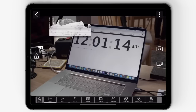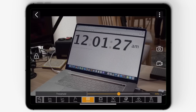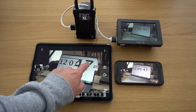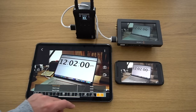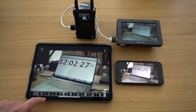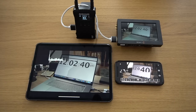The HollyView app gives you a ton of features: waveforms, histograms, focus assist. And if you hold any one of these, you can drill down into the menu and change settings — for example, adjusting transparency. Turn on the zebras, and if you hold down you can adjust the threshold. You can really get into the granular settings of these additional views. There are frames with different frame safe viewing options, a magnifying glass to check focus, false color, color options, and LUTs — you can even load your own LUTs in to see what the shot would look like graded on the monitor. Each device acts independently, so you can have different data and graphs shown on each one — for example, give one iPad to a director with all the information they need, and another device to a client using the magnifying glass to check what's in the background.